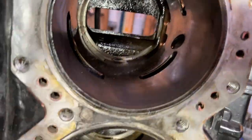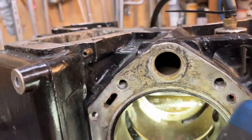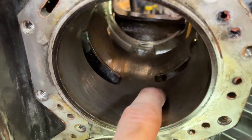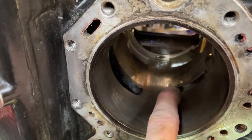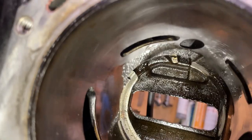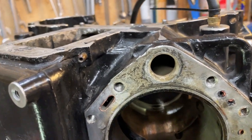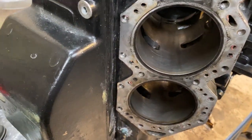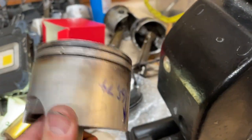The cylinders — all of them. I found that some of the edges around here were a bit sharp, so they also have to have a chamfered edge, so that when the piston ring comes towards the edge it has a small chamfer to catch the cylinder wall again. I also found there were some groovings — scratches on the edges from the honing or bore. So if anyone has any idea what to do with either the porting or the pistons, I'd be glad to hear.